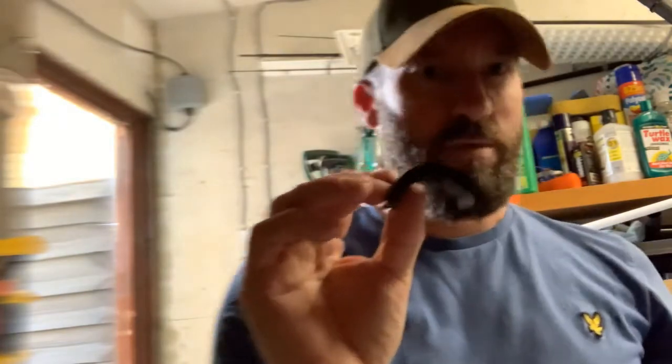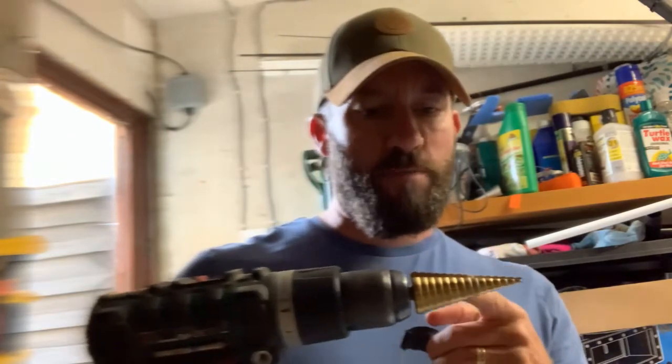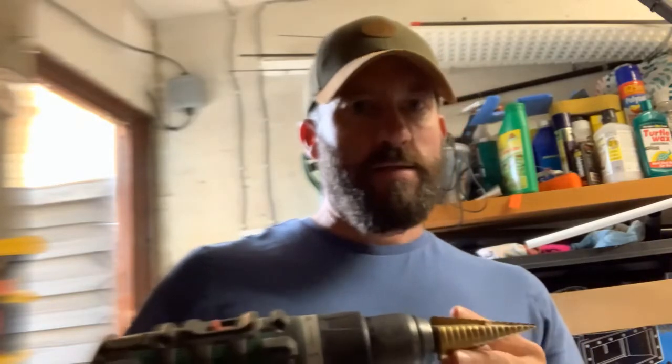It's quite thick rubber. I think it's from some kitchen bits that I had left over. So I think if I do that, that's going to clamp around the skimmer. Might give me a little bit more protection from it possibly leaking. I'll probably run a bead of Arbo Seal, or CT1 or whatever I've got, around it. But anyway, I'm going to drill the side of the skimmer, 22mm for the diameter of the pipe with this drill bit, and see how I go from there.